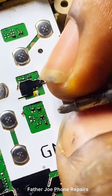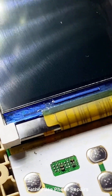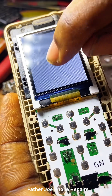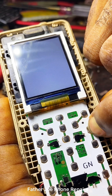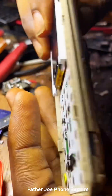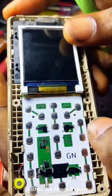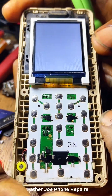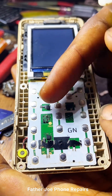I recommend you remove it. After you are done removing the capacitor, keep it aside and test it to be sure if it is still shorting or not. You need to test it to be sure. For me, after I removed the capacitor, I tested the phone and it was still showing white. So I removed the battery and put it back again to see if it would work — and it was still showing white.